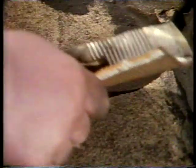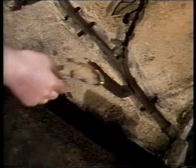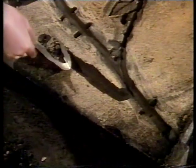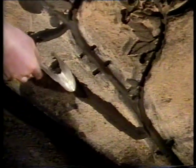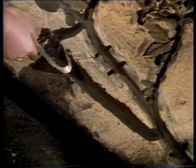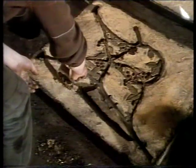As soon as this repair work is completed, channels are cut which will carry the molten metal into the pattern by way of the ports in the top box. There are two openings for delivering the metal to this garden chair, which will have to be poured simultaneously to maintain a constant flow and pressure.